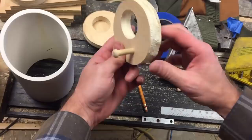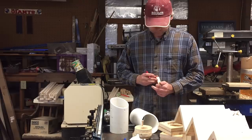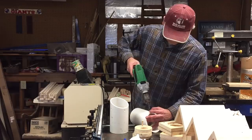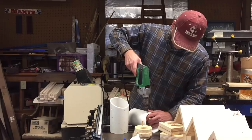The ply that I have is five plies thick. I'm taking a red marker and marking the center ply. This will allow me to line up the center of the ply while looking down through the pilot hole, so we're going to look down there and make sure everything is lined up, and then secure it. I'm just using a number six wood screw — it's not threaded all the way to the top. This gives us the way to grip into the ply and still be able to snug it up nice on the pipe.